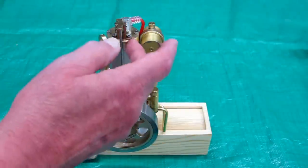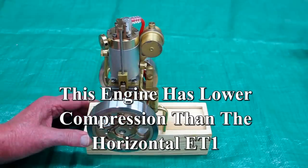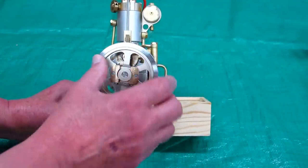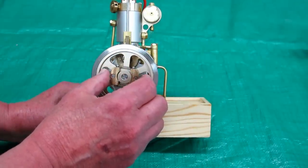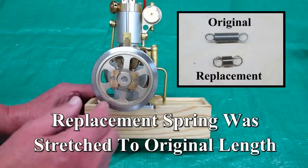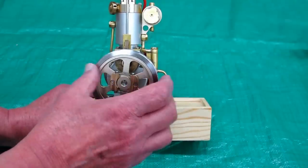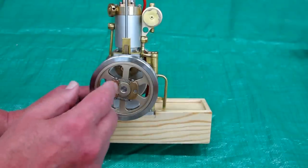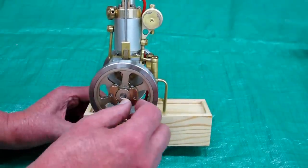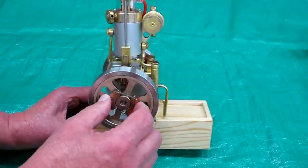To get this running like a normal hit-and-miss, one way is to lower the compression a little, and another is to reduce the tension in the springs on the governor so it expands further and stays out longer. These are not the original springs — they're about half the strength. I don't like taking a spring off one side because it's a symmetric mechanism and removing one side causes it to open cockeyed, which over time would probably cause wear. With these lighter-weight springs, it now runs pretty well.